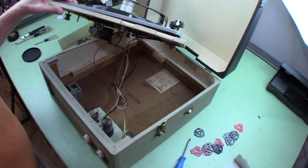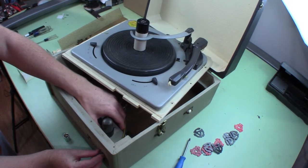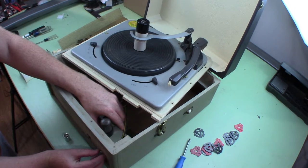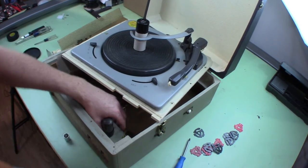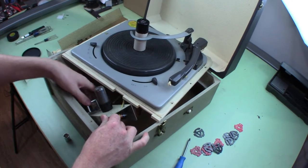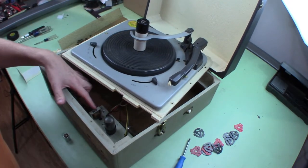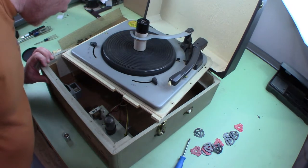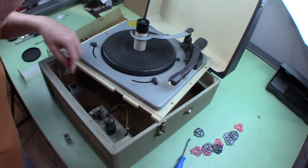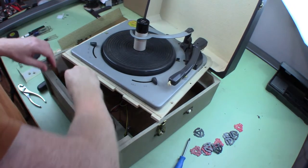Let me get this amplifier off the front so we can take a look at it. The amplifier was held on by the nuts on the pots, but what's interesting is one of the pots has two nuts and the other has none — somebody's obviously taken it apart before. I'll need to unsolder the audio transformer from the speaker or just remove the speaker. The nuts are a little corroded but they actually came out okay.